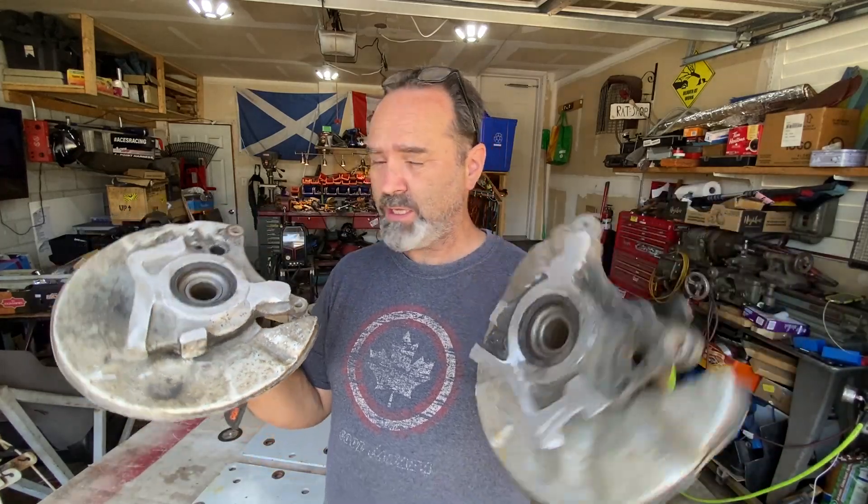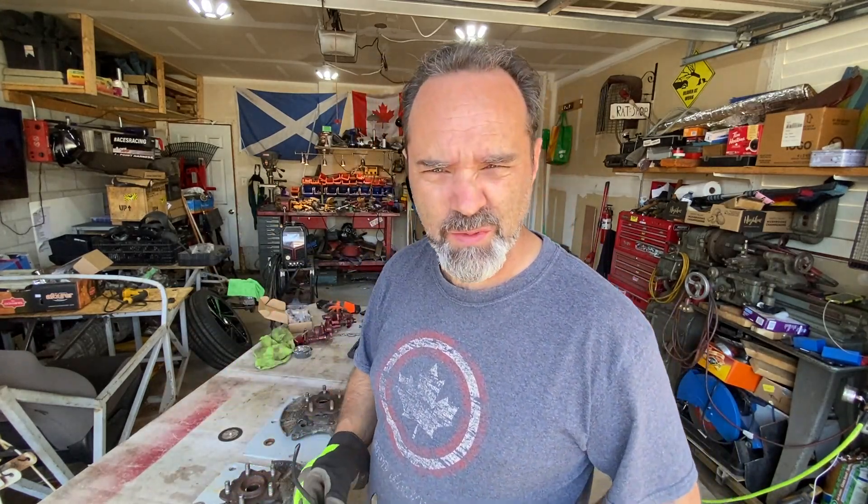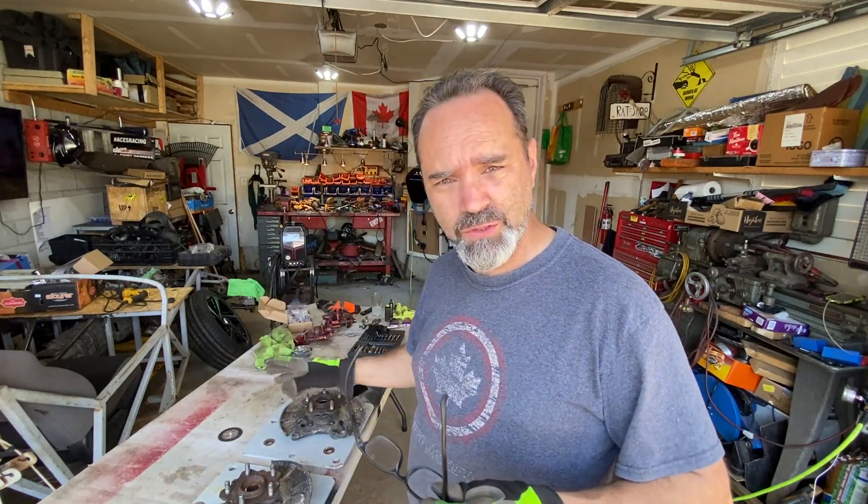Both hubs are done. I have to say, cutting and filing down aluminum - it's really nasty. Make sure you wear proper eye protection, mask and protective jacket. It's specifically nasty because it doesn't spark, so you can't see when the little bits are flying about and getting in your face. So wear a mask. Let me show you what we're doing next.